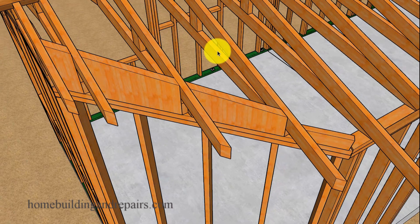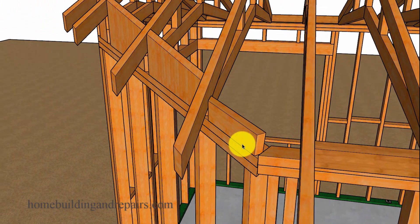Down here I added a small block because we're not going to need a large one here. You can always continue the shaped block all the way down — I just wanted to provide another example. We're going to need some straps here to tie the wall framing plates together, and that will be at both sides — this side and this side.